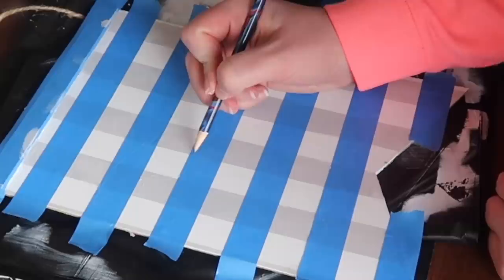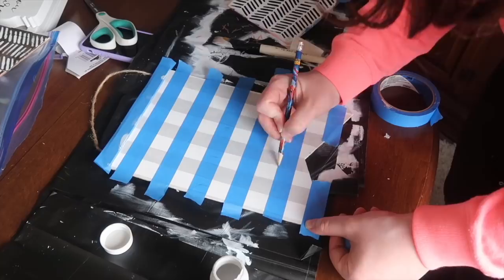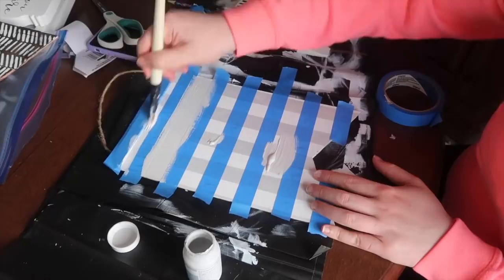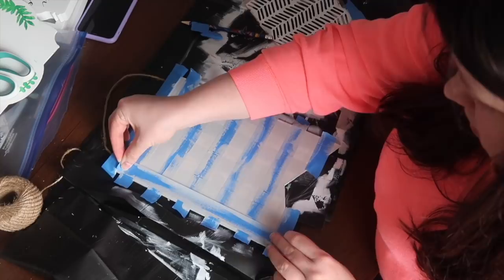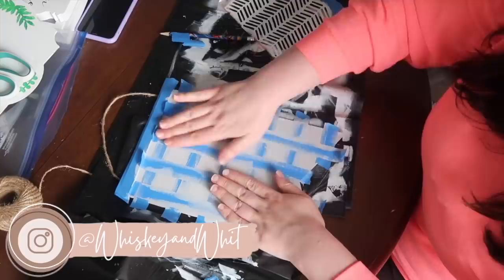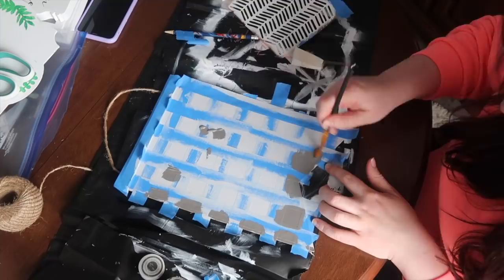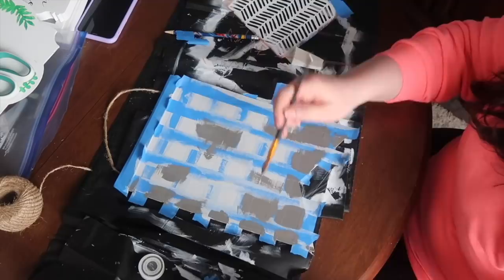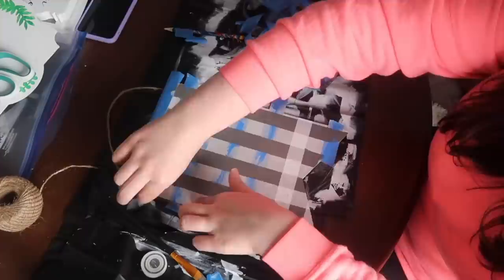Here's a trick if you're worried about putting the tape in the right spot: mark yourself some lines and put X's where the painters tape originally was, where the white lines are. That way when you go to paint and can't see through, it'll tell you exactly where to put the tape back. Same color — paint it, let it dry, then stick your painters tape right back on top where you marked it. You're basically creating a grid to show where the lines overlap and where the dark squares should be. Then I went through with the color Elephant and painted those dark squares. I don't wait for this to dry — I go ahead and peel the tape off to reveal my buffalo check, then let it dry fully.